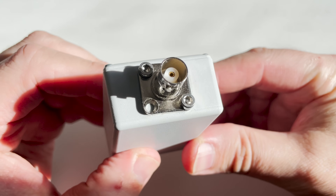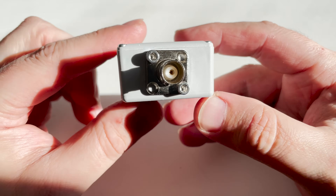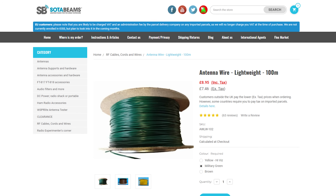Not using an ATU means one less piece of equipment you need to carry if you're going portable. Power rating would be around 50 watts SSB, while CW and digital modes should be kept to around 20 watts. With this transformer design you could also use 40 meters of wire, which would give you roughly 80 to 10 meters without an ATU — but for portable use, 40 to 10 meters would most certainly be sufficient.